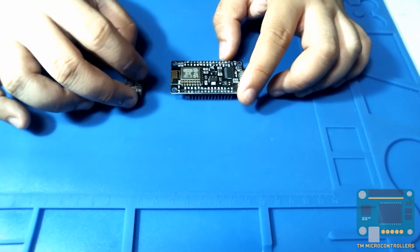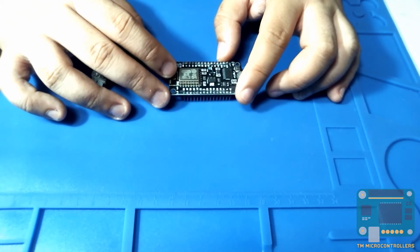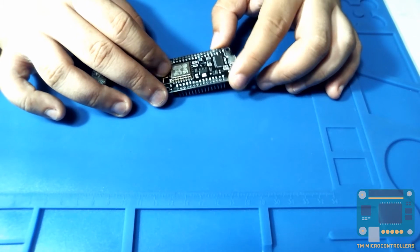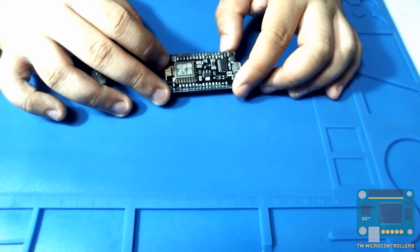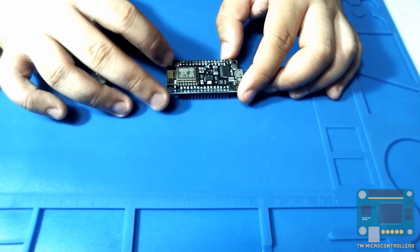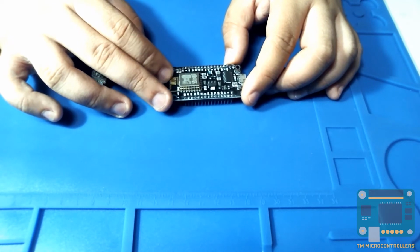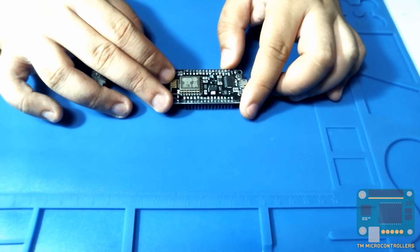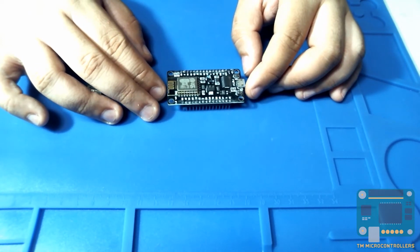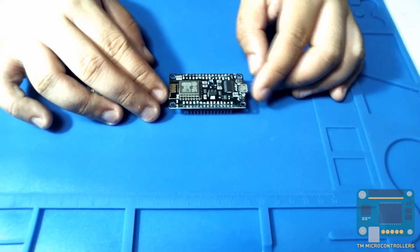Okay, so basically, this is a microcontroller. The ESP8266 is a microcontroller which you can program, with added Wi-Fi or internet connectivity capabilities. Actually, this is not the best Wi-Fi device to use for now. For example, I would recommend the ESP32, but it's a good starting point for those who are new to Arduino programming and want to add Wi-Fi capabilities to their Arduino projects. So here, I will show you how you can configure or use this board using the Arduino IDE. Basically, you will be programming this board with the same programming language that you use to program your Arduino.